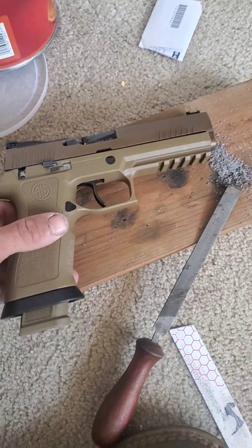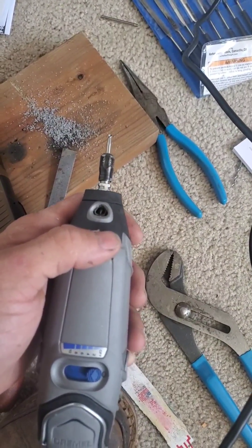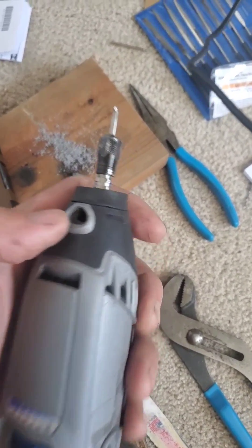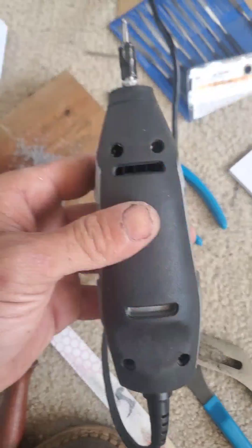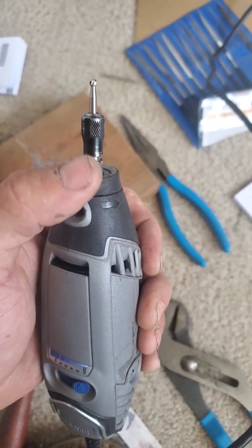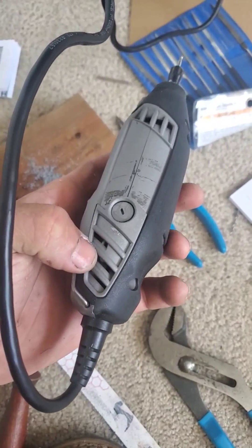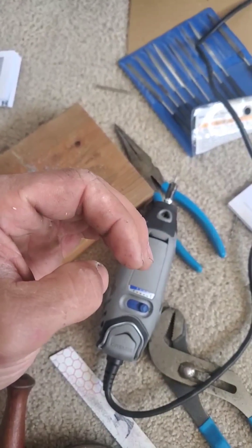So I was doing a little gunsmithing yesterday. I took a Dremel and started making that cutout, and the arbor lock has stripped, and the little tab that goes in the arbor lock — it's a little pin — it's stripped as well. It's soft enough steel that I've filed on this and even my pliers cut it. I had to take it apart in order to jerry-rig it enough that I can still use the tool. Their connections in here are literally just a little press-in piece of brass tab that locks on a soldered end of wire.